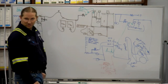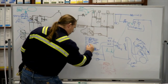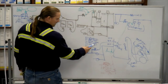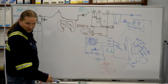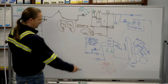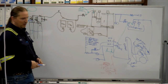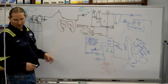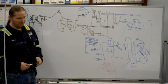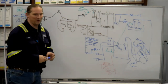Second, slurry pump. So, hang on, there is a high pressure surface water pump in the turbine building. It has considerably less volume, considerably fewer gallons a minute that can go through it than the big pump. But it is kicking up from 120 pounds to 180 pounds, and that is what provides enough pressure to the slurry pump and the FGD pump seal water, as well as the hose taps all the way up the boiler. You wouldn't have 120 pounds, I don't know what the water pressure would be like when you get 200 feet up, but it wouldn't be what you need to wash down.